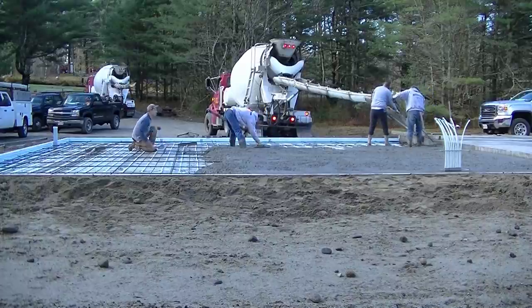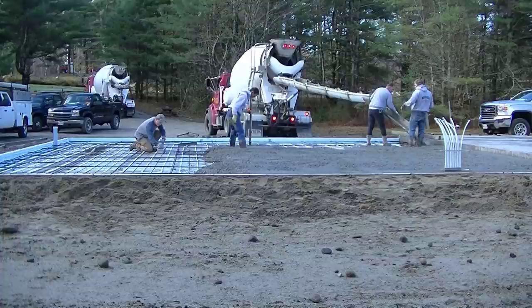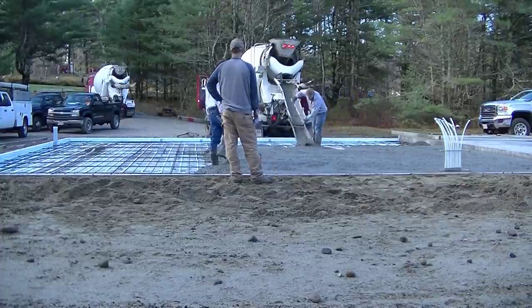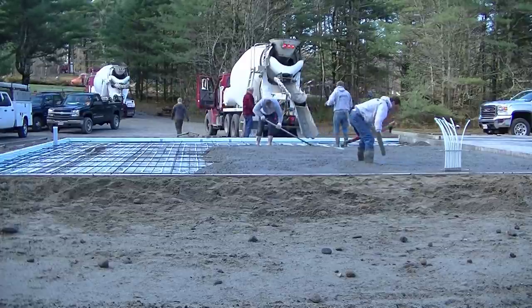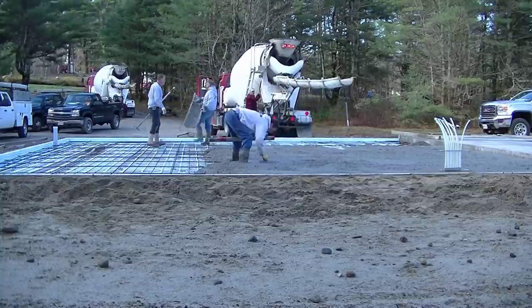I'm making a pad there with a laser — I've got my grade stick with a receiver on it, setting height in between those two drains for our floor. We wet-pad everything and kick screed. Sometimes we'll use a laser screed, but we definitely don't use a vibrating laser screed on a floor that has a pitch with drains like this one. We just kick screed it so we know all the slopes are perfect.